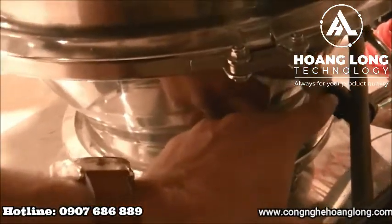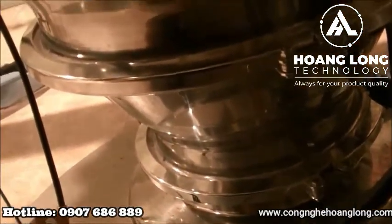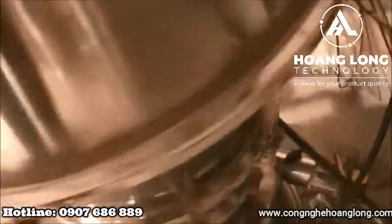Also on the discharge on this unit we have a fluidization cone like the feed station below. Same concept: a low pressure air curtain behind a high density polyethylene cone gives a nice air curtain to prevent product from hanging up on the conical wall here.